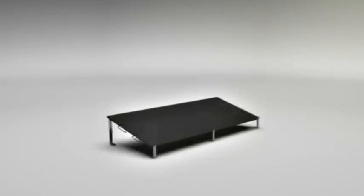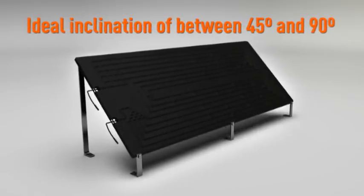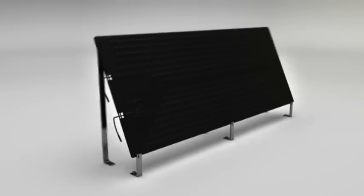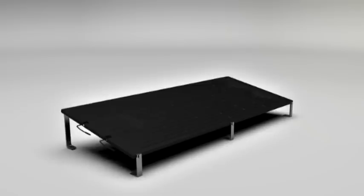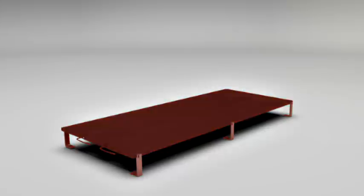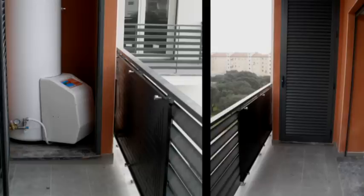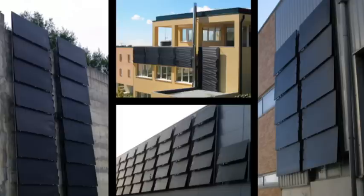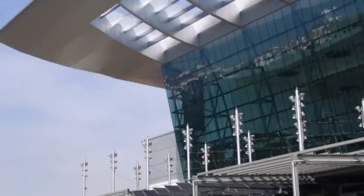The inclination angle of the solar rays in relation to the ground varies according to the seasons of the year. To make the most of the energy emitted by the sun, you should choose an inclination of between 45 and 90 degrees. However, the panels can be installed with less inclination, but should never be completely horizontal. The technical component of the installation should always be balanced with the aesthetic component, which is why the panels should be installed on rooftops, verandas, walls, the ground, or other locations best suited to sun exposure.